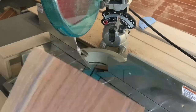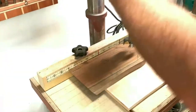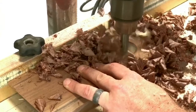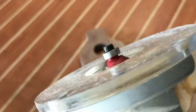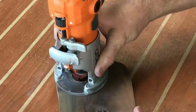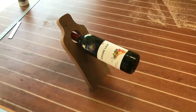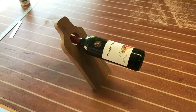I trim off the bottom at the crosscut sled and cut it to a 33 degree angle — that works really well with the size of the material I'm using. I take a few careful measurements to make sure the hole is going to be drilled right into the center of this display. I use an inch and five eighths Forstner bit to put a hole right through it, with a piece of scrap underneath to prevent blowout. A quick chamfer around the edge of the circle — nothing more than about an eighth of an inch on both sides. Then it's time for a test fit. Looks pretty good — back and forth, back and forth. Looks like it's found its center of gravity pretty well.